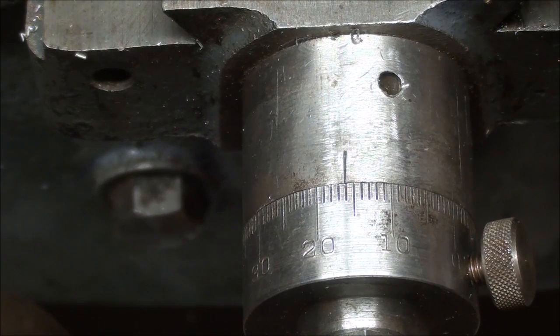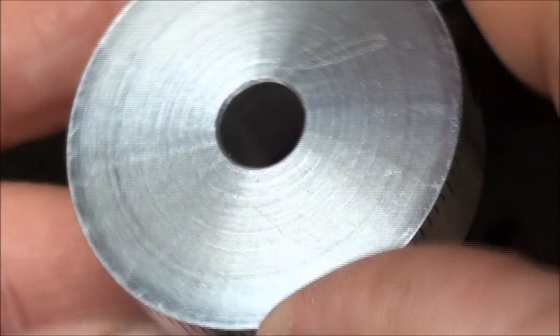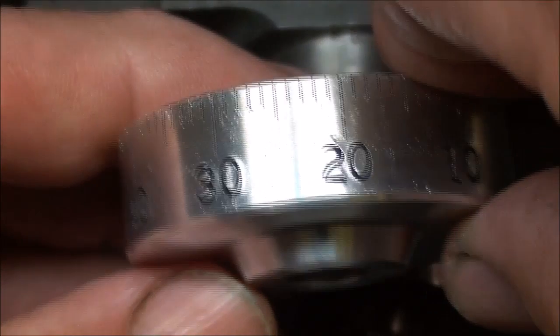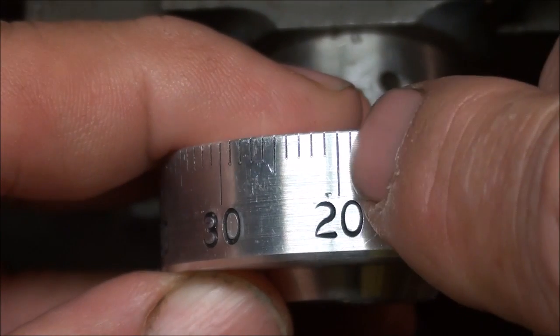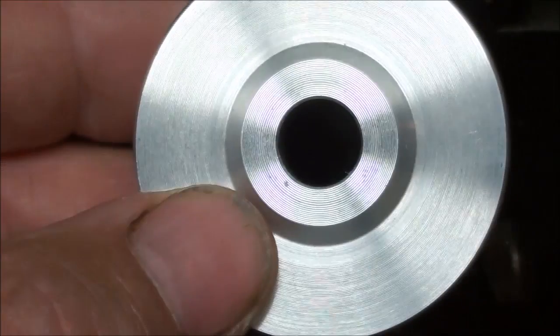When I make new dials, I'm going to make them out of aluminum. You can see how much larger the dials are — about 1.75 inch diameter — and that moves the graduations farther apart and makes them easier to read. So this is what I'm going to make.